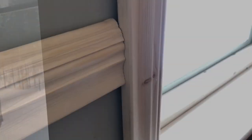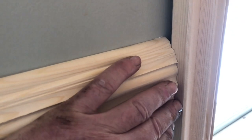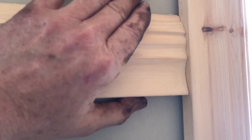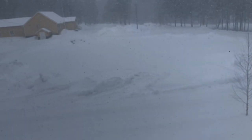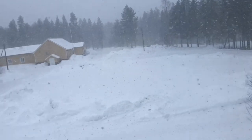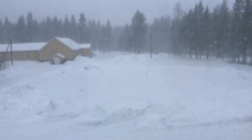I know what I was going to show - we can use this as an example. So what I was talking about: we're cutting the wall into the trim. If you were to put the trims on afterwards, you would get all these horrible gaps. So the only way you can use all these moulds and not get lots of horrible gaps is to cut the wall in against the architrave - not put the architrave on top of the trim. So I'm going in and I'm filling my pinholes. Standing here in front of these huge windows - this is what a weather forecast that says no snow looks like. So that's no snowing today but a lot of heavy snow tomorrow. It's cool though - what a place to work.